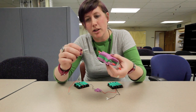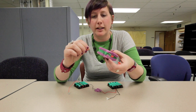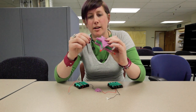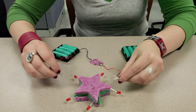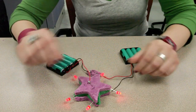One thing that is really important is to make sure that you have all five LEDs in the same orientation. In this case, we will have the bottom layer being the ground and the top layer is the power. Once you have all five LEDs oriented in the sandwich, you can then power the circuit. And the LEDs light up.